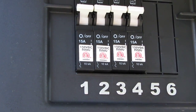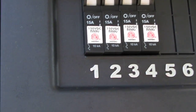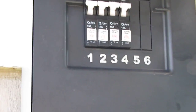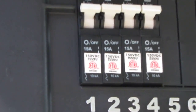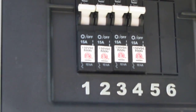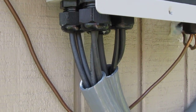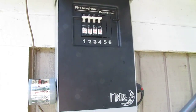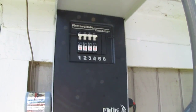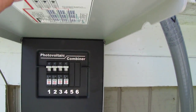I got four solar panels — four 135-watt Sierra Solar panels — and I've got them wired in parallel. I just didn't like series; parallel seems to do better for me. Here's all my cables coming through from the photovoltaics, my lighting, and all my grounding equipment coming from the four solar panels.